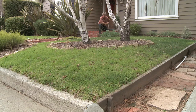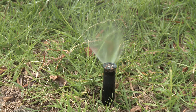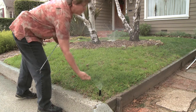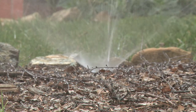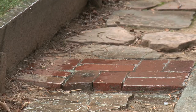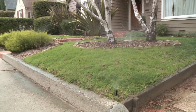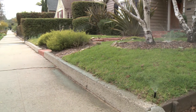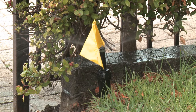Turn this on ever so gently. You can see that this sprinkler is below the surface here, so I'll probably bring that one up a little bit. But the most important thing at this point is you can see the sprinklers are spraying out onto the driveway, so I'm going to flag that one and check the throw on that sprinkler head. And if you look in the corner, we also have another one that's spraying out there on the sidewalk.